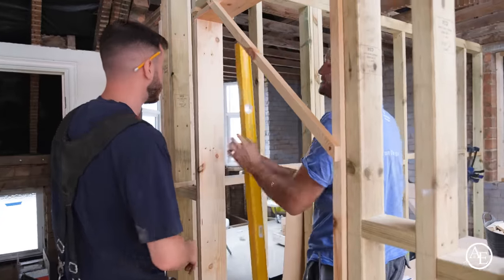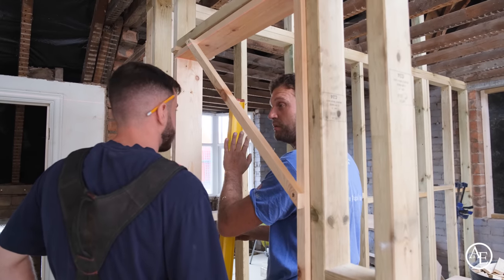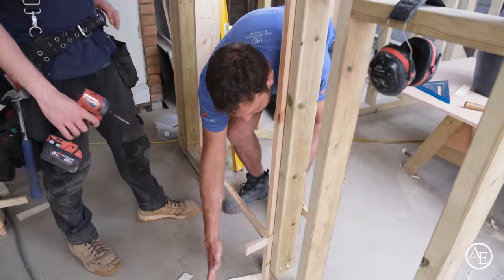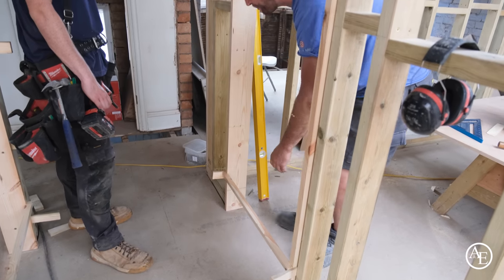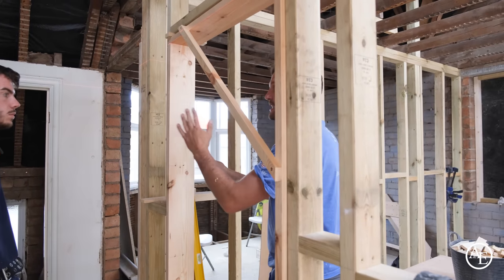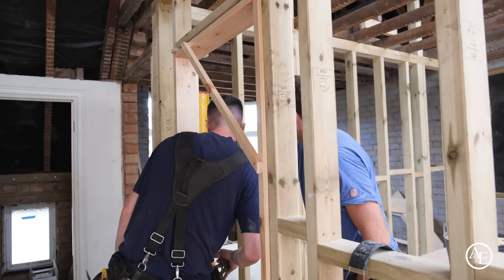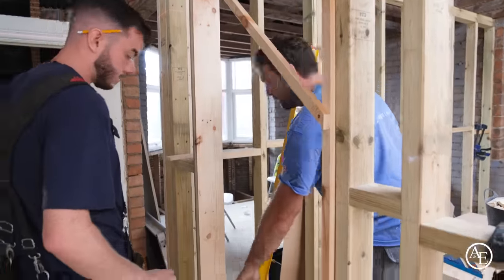When you check plumb, always go off the side it's opening onto — the hinge side. If you look, it's got to come in at the bottom. Just tap that along. What I like to do — put one wedge like that, and one like that, give it a little tap. That now makes it rigid so you can tap without any risk of it springing around. Then just touch-tap it in, but don't damage it. Now put a screw — loose — in each and every one of these holes.